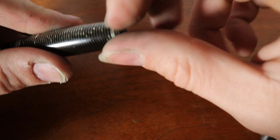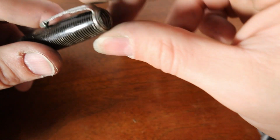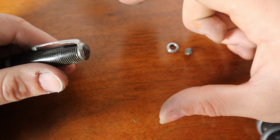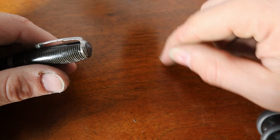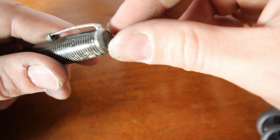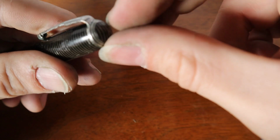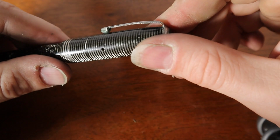So I keep trying, I'm turning, I'm trying to see if maybe my thumb friction will be enough for it. At certain points, I use my fingernail to try to get in under the jewel just to see if I can break up anything that's sticking, but that's also just maybe not the smartest thing you can do. If you put too much tension on that jewel, you can actually break it off from its threaded stem. So I don't like that I keep doing that. I really should change that practice.